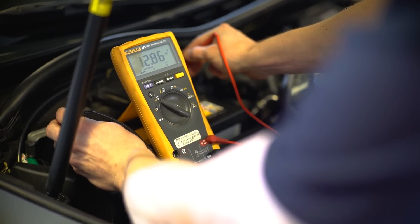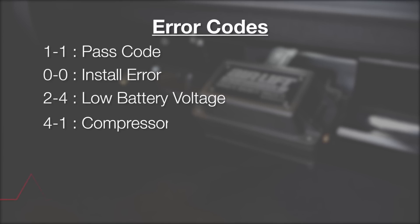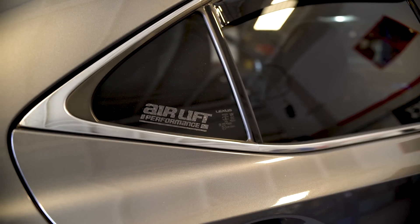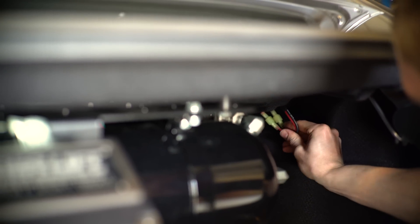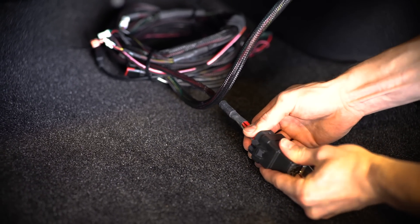Codes 4-1 and 4-2 are very similar, both indicating errors involving the compressor relays. 4-1 refers to compressor 1 and 4-2 refers to compressor 2. One of these errors indicates a bad relay or relay connection. Check to make sure the relay hasn't been temporarily removed and is properly installed, and also check the connections from the main harness to the compressor.